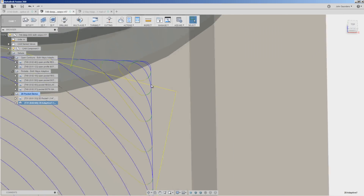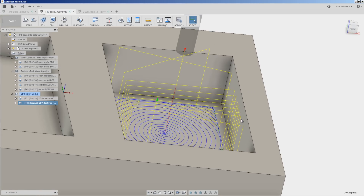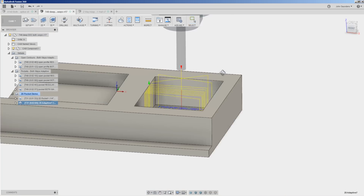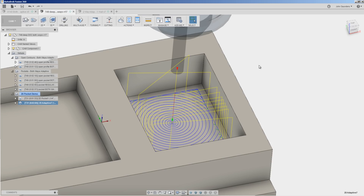And that's why, as it approaches corners, we see these progressively smaller cuts. One of the most common questions when folks first see an adaptive toolpath is: don't these linking moves shown in yellow mean it's a much slower toolpath, because the machine's not cutting — it's just repositioning the tool in air? The answer is, well, it depends. The tradeoff with adaptive is you're able to run the tool harder, because you're never going to surprise that tool with a disproportionate amount of material. So we're able to use optimized speeds and feeds for the whole cut, instead of having to decrease our speeds and feeds just so we don't overdo it when we hit a corner. But the idea of trading off those yellow linking moves — where we're not cutting — is the idea behind both ways adaptive.